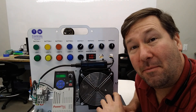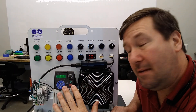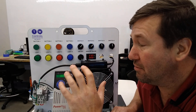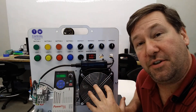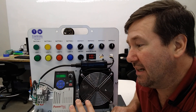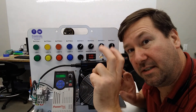Hi, this is Tim. Today we're going to talk about how to run your Allen Bradley PowerFlex 525 drive from the front keypad, and probably more importantly how to navigate to some of the drive parameters, such as your current speed, your commanded speed, the voltage going to your motor, and the amps going to your motor. Those are very important things, but it's not super intuitive about how to get to them, although once you do know how, it is very basic.